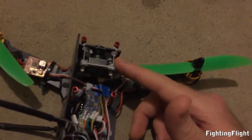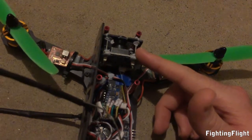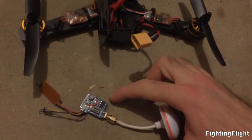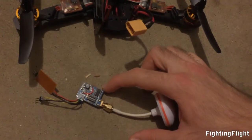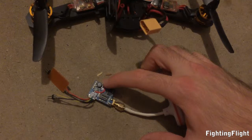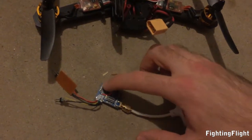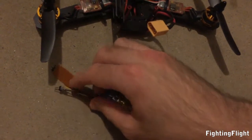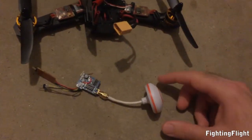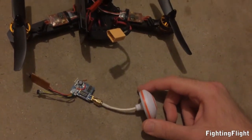It's got an FPV camera, the EDMAX CMOS camera. For the transmitter, I'm using the Skyzone TS5823. I did have a problem with mine with the DC to DC converter dropping out — I'll do a video on that later. And I've got my little regulator board over here. We've got 5.8GHz Cloverleaf antennas.